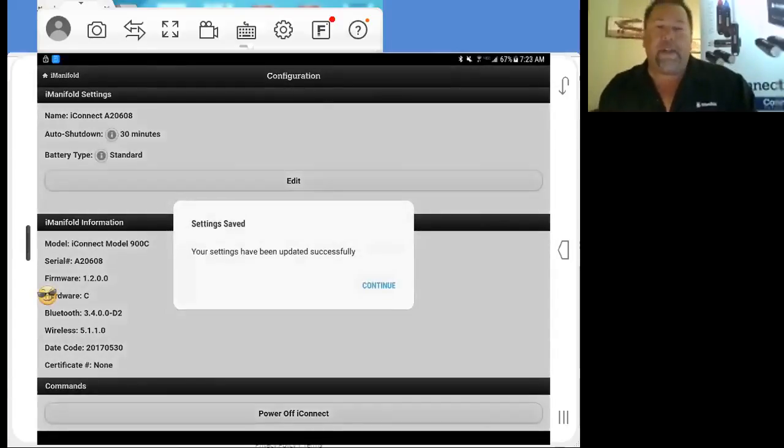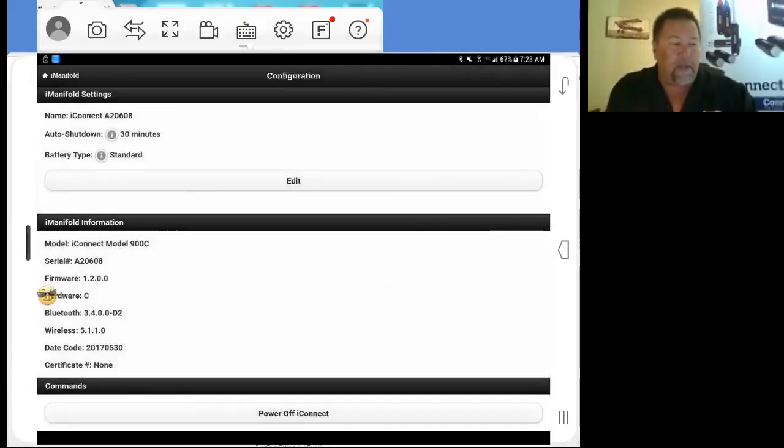When you come into my classes, these webinars, I always accentuate submit. Submit, that button's your best friend as far as iManifold and iConnect. When you go into changing a menu item, if you're putting in information, make sure you hit that submit button. If you hit back on your phone or your pad instead, that information will not get submitted. So don't use the back button. Just act like it's not even there, because you can get wherever you need to on the menu on your screen.